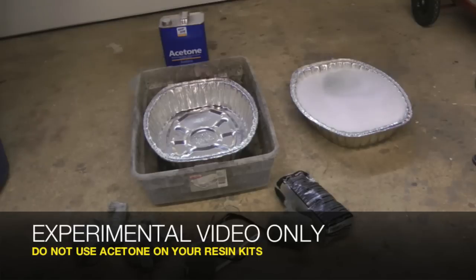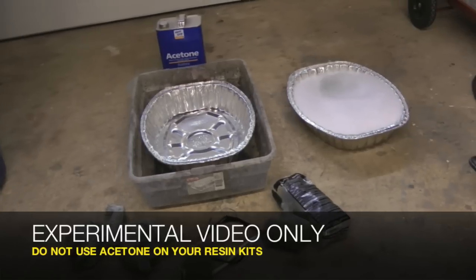Like I said, you do this at your own risk. If you've never really worked with acetone and don't know the results, I suggest you use the degreaser — it's safer. But if I'm going to be doing a lot of kits, I could just take them all, do them in the acetone bath, get them done, and go from there. After this you have to let it dry though — I'll probably run it through some water afterwards and let it soak. You'll probably let it sit for a day or two, then prime it up and go from there.